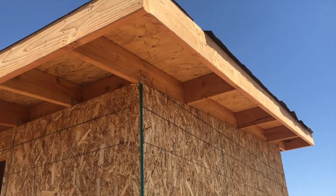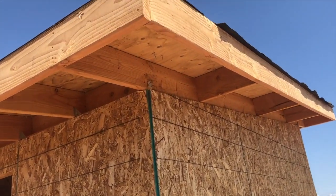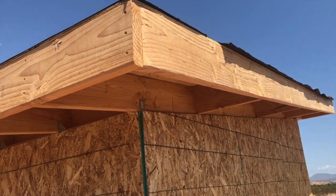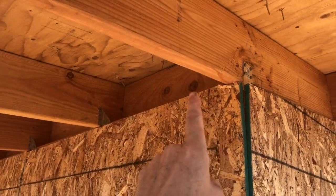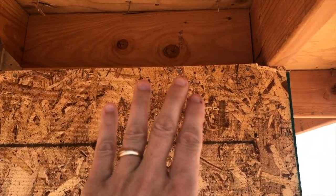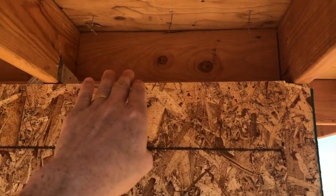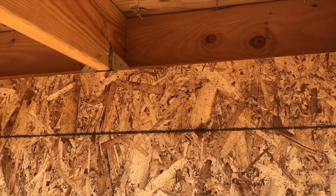So I just want to talk about something — I thought I had an idea of what I was going to do, but I'm changing my mind. This is kind of the underside of the roof — this is the overhang. I've done the sheathing and taken it up to the rafters. I had this notion that I would add more sheathing up into these cavities all the way up to the roof sheathing. But maybe you're noticing that would be a whole lot of work — cutting all the pieces of sheathing to fit inside here, cutting all the pieces of siding to fit inside here, cutting the house wrap to fit up in there between all these rafters, and the same thing down the side of this blocking. I don't really want to do that, and I don't think it's the right thing to do. Also, if I just stop here, there's a little shelf that I think would be a home for critters and birds.